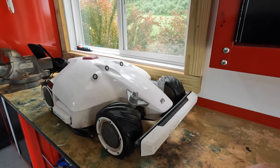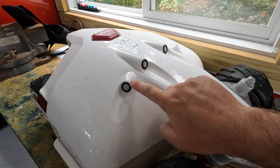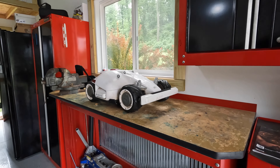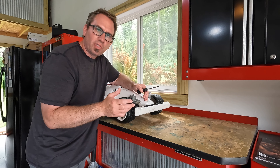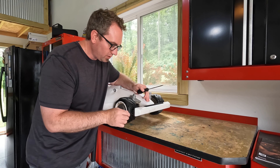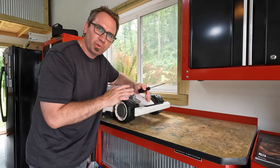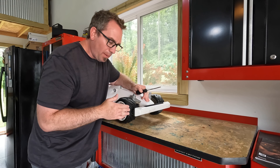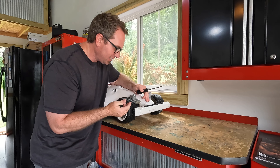This obstacle detection could be a number of things: the bumper has it on front, there are side buttons, and the ultrasonic sensors. We're going to try to figure out what's causing it. The reason the bumper tore off is those impacts in front with the concrete blocks and retaining wall — places where it's not supposed to go but the positioning gets off a little. I've noticed it's especially bad on very humid, hazy days, as that seems to mess with the GPS signal the most. Small trees or bushes on the edge of the lawn can also get caught, and then when it backs up, it just pulls the bumper off.